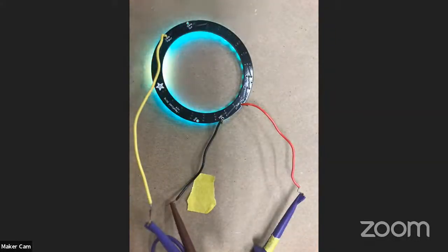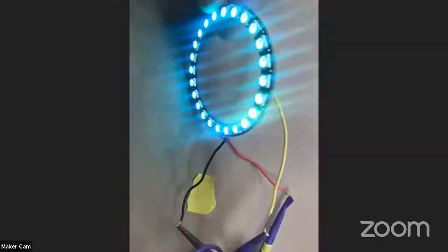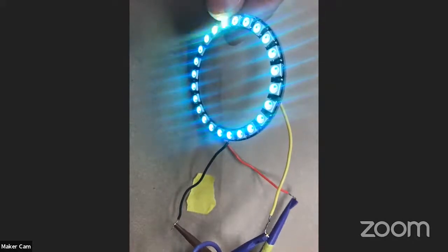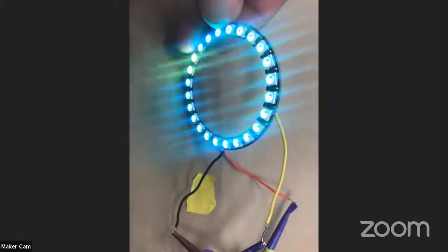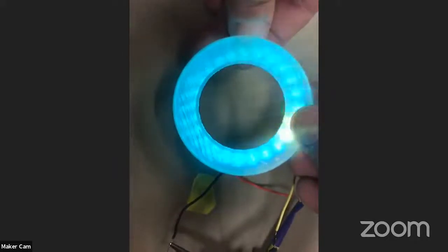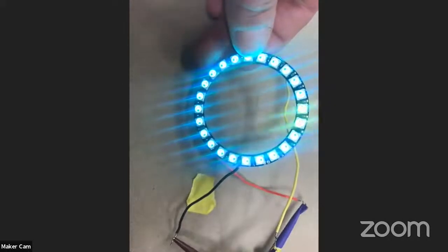You should be able to see the LightLogo has a procedure going from when we were testing. There it is in all its brilliant glory. This brightness right here is 20 out of 255 — about 10% of the brightness it can go to, which is pretty amazing when working with diffusers. We put a diffuser on it and this is at 10% power. We could go ten times more but it would just show white on the camera. These NeoPixels are an incredible value — a pretty sophisticated piece of hardware for not a lot of money.